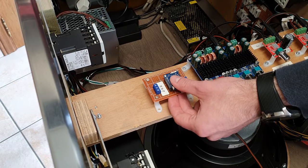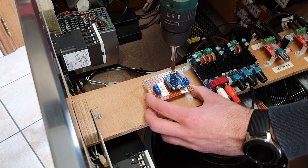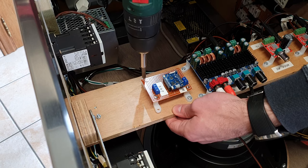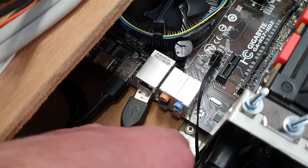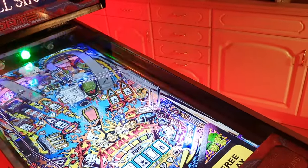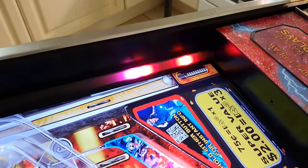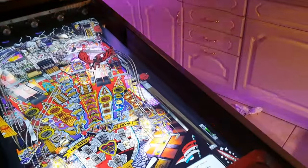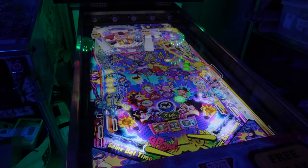The LEDs will be controlled by a separate D1 Mini Pro — a cheap microcontroller that has precise timing, which is necessary for this kind of LEDs. I made a small PCB to easily plug in the D1 Mini as well as connect each LED strip. The microcontroller itself plugs into the PC, from which it receives its commands. Now it's obviously time for testing. These strips can light up each LED individually, allowing for very neat effects when the ball sits idle in the shooter lane. They can also mimic the in-game flashers, lighting up in the same color and position, and some tables have a chase effect when you launch the ball. These lights really add a lot to the light show of the cabinet.